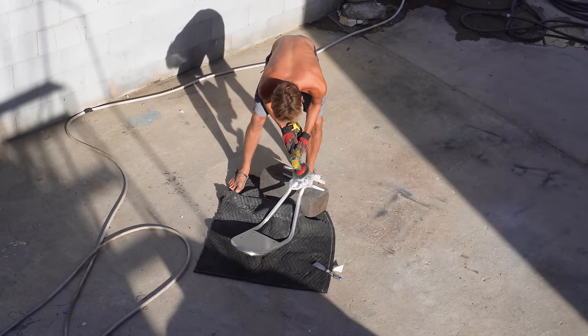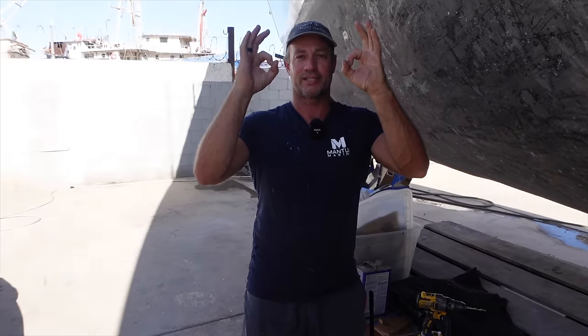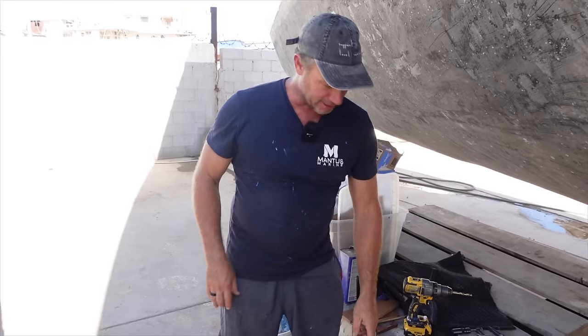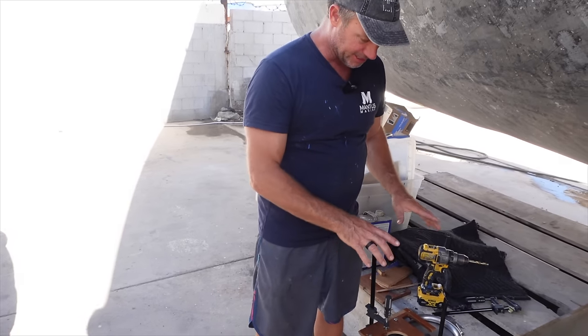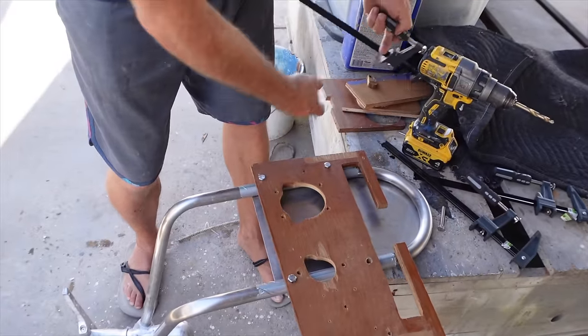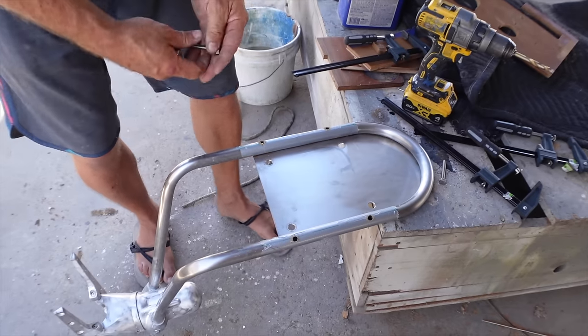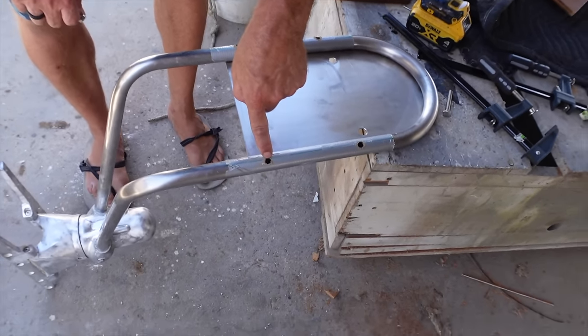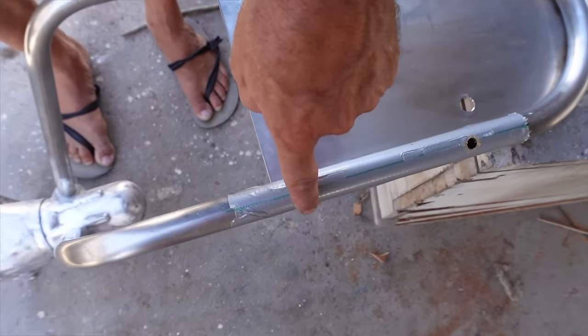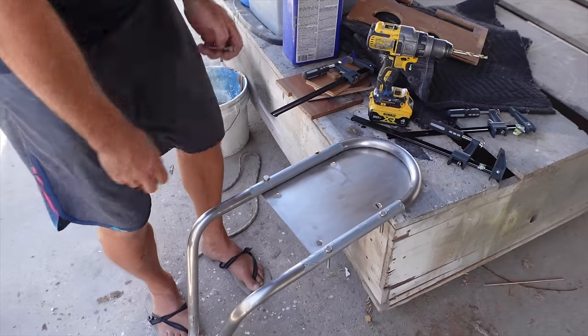Taj has cleaned up this bracket yesterday. It looks a bit ratty what I'm doing here but I actually had to make a template up, a bit of a jig. The two bars around the edges - our bolts are on the off side of center so it's quite hard to get my alignment right. The old one was on the plate so I just made a jig up, positioned it where I wanted it, and then drilled the bolt holes off center. I templated that off the radar and as you can see there's center here where my finger's pointing - that's where I've had to drill on the outside of center, so it's quite a hard little drill to get right.